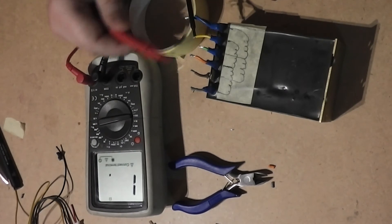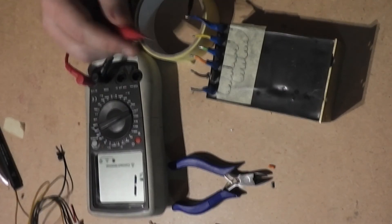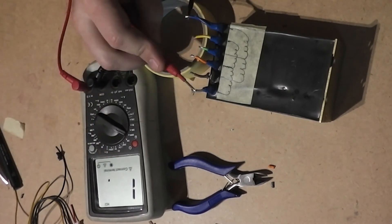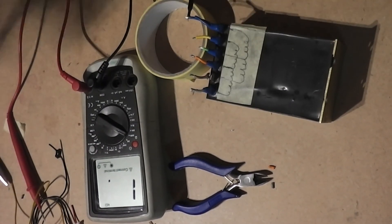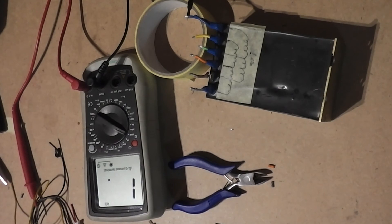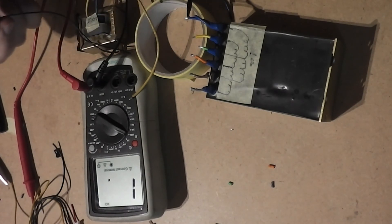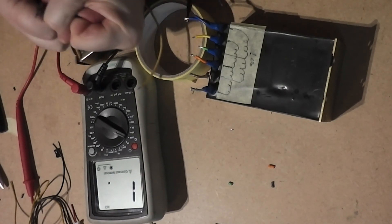Check the resistance of each coil if you can find which is the primary coil. In this case I'm not so sure, so I will leave this transformer to check it later. That would be all about how to identify transformers. Down in the description is a link to another video which describes how to find the exact power of an unknown transformer, and also a link to a website where everything is explained very well. Thank you for watching and I hope this is going to help you — subscribe to stay in touch, and see you in the next video!